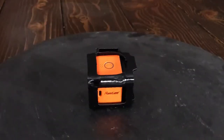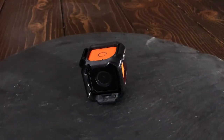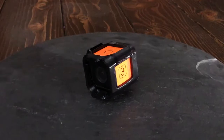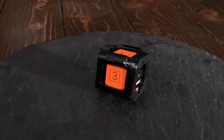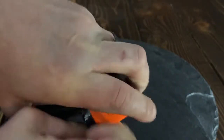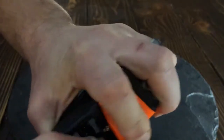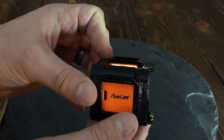The next thing I want to show you is the RunCam 3 case. I knew this would be a challenge for the printer — and for any Bowden style printer — because it's flexible material. Anytime you're printing flexible material in a Bowden tube there's a higher risk of jamming and you have to adjust the printer settings. But I had no issues with this — just a higher temperature and a slower print speed — and the quality came out really good. I had to remove some supports, which came off just fine.